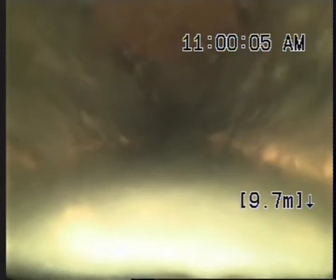So I do know that there's a PVC pipe which is discharging underneath the deck at the front. That's probably our best option as far as cleaning your line out. But due to the bends, basically from the back section here, I can't go any forward from here.